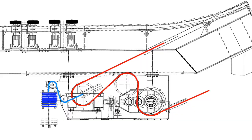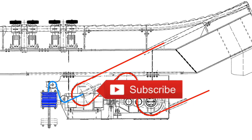So at the very bottom of the lift hill, right as you come up to the lift, the last sprocket that chain went around, that sprocket down there is called the tail. That's the tail sprocket. That's the first one you pass on the lift hill. As you go up the lift hill, on woodies, they're typically right there. You can see them. On most steel roller coasters, they're down below the track and you can't see them. But that's the tail sprocket, and it goes up and over the top.